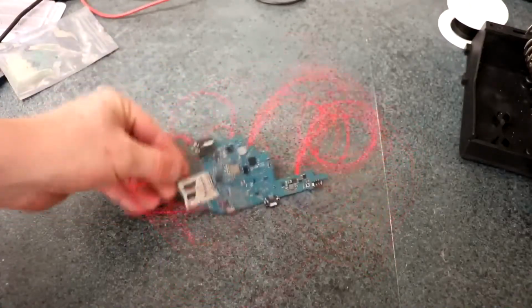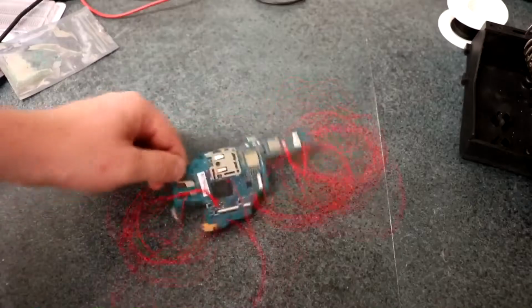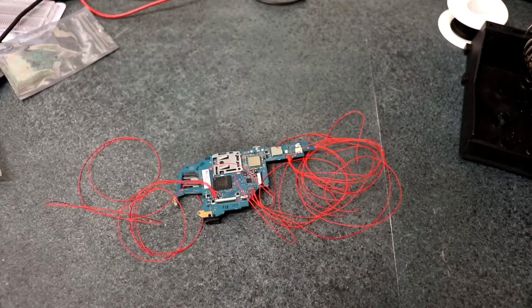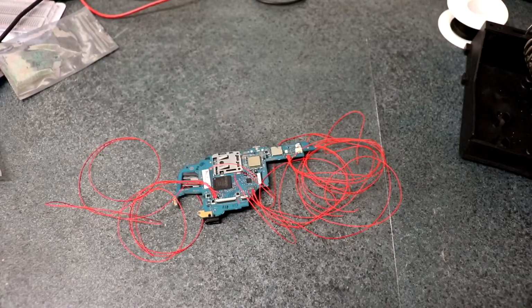It's quite good though as well, because the pads are generally under here, four pads, so either way it's quite easy. There's just a little variation in that with your analog sticks. But you need to make sure you get all four lines, and it's very important that we orientate these the correct way. So without going into it too much further, I think it would make more sense if we actually start delving into how this analog stick is pinned out, and we'll solder onto it now and deal with the next bit. So let's get into it.